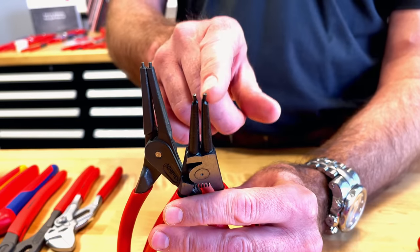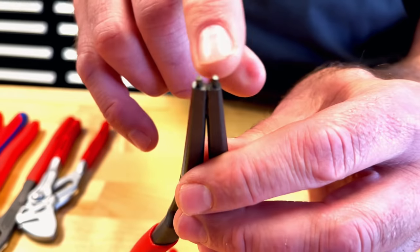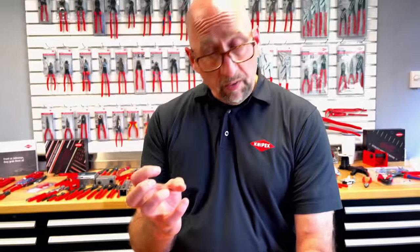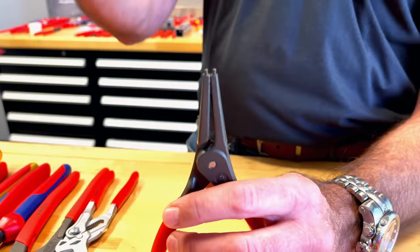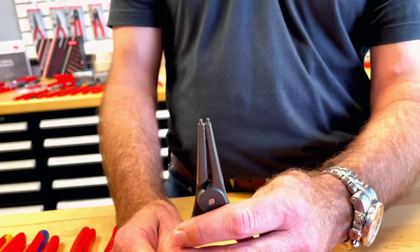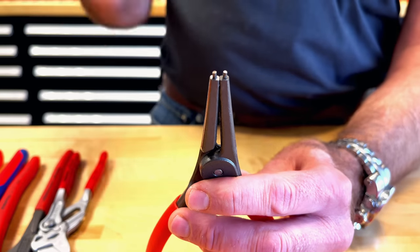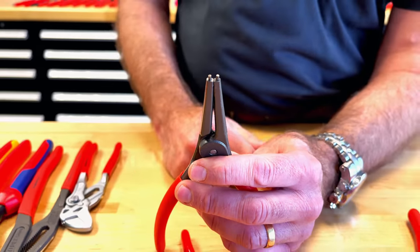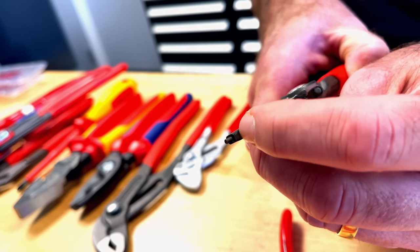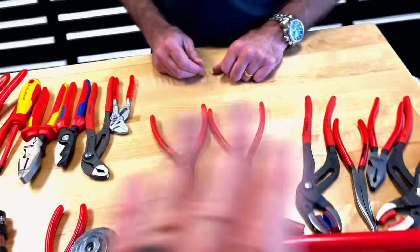Here's the really cool difference: on the standard version, the tips are forged from the one solid piece. But on the precision version, those two little tip points are a different material — they're spring steel, which gives them a little elasticity. Because when you're removing snap rings that are stuck, you need to work at them, and that flexibility gives a little expansion for the snap ring as you're putting it in or taking it back out. These tips are actually hand-set in the factory — you can see the little dimple where the tip is inserted by hand and then dimpled over to hold it in place.